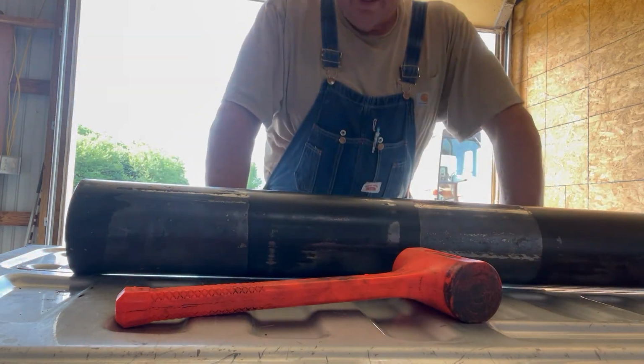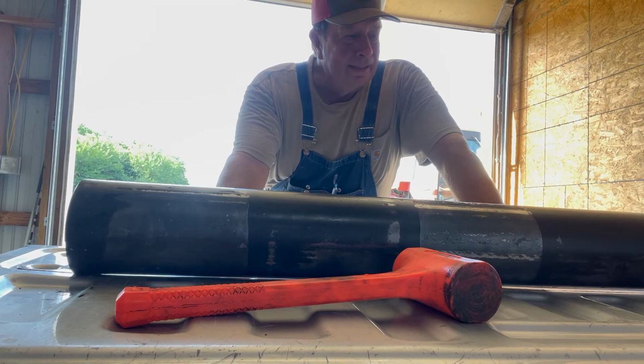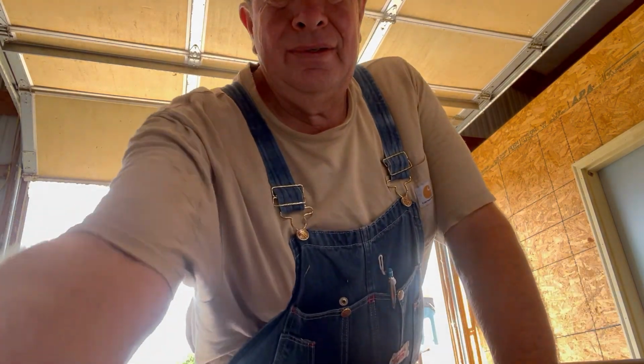That's the fun part. Getting this heavy thing up in there and getting bolts started in it, that's going to be the fun part. I devised a plan to get it out. I put a couple of ratchet straps around the roller above this roller, and then kind of made a sling for this roller with those to hold it when I took the bolts out. So now I'm going to have to put this back in the baler and thread it up into my sling, my ratchet straps, to hold it, and then hopefully swing it up to where it's supposed to be and get the bolts in. I'm hoping it fits tight enough in there that it doesn't just swing freely. That's unlikely, but hopefully that will work. We'll see. So we'll go do that.